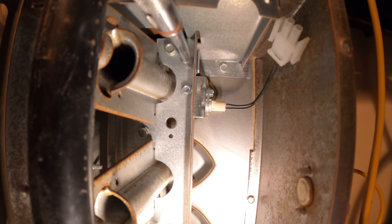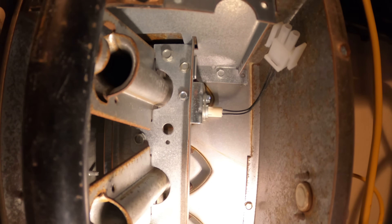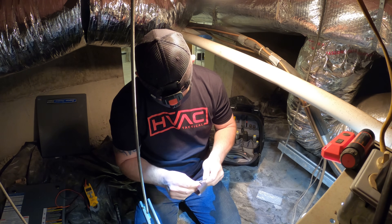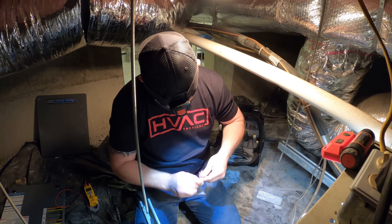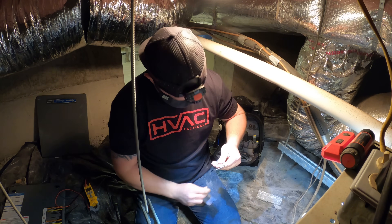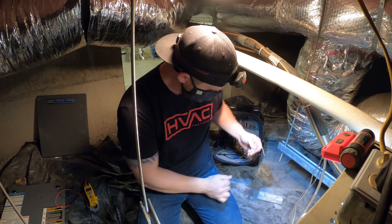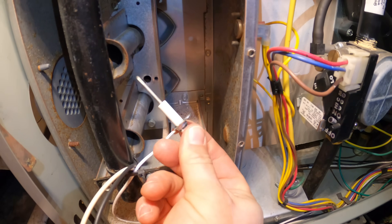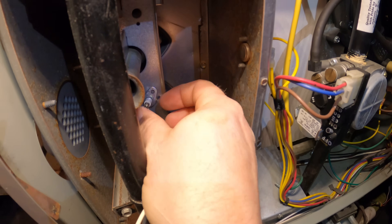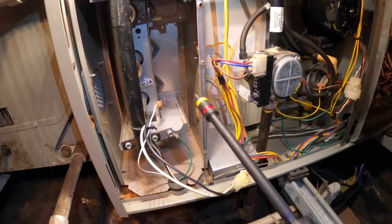This is a 90-plus furnace, so typically you can have fresh air ducted or vented from outside, but this one isn't. So it's really not that big of a deal, but I ended up putting it back on at the end. While I was in here, I figured it was a good idea to go ahead and remove the flame sensor and get it cleaned up — something quick and easy that you can do to prevent any callbacks. The way these things are designed with that one eyelet for mounting, there's only one way you can put it back in, so it's pretty simple.